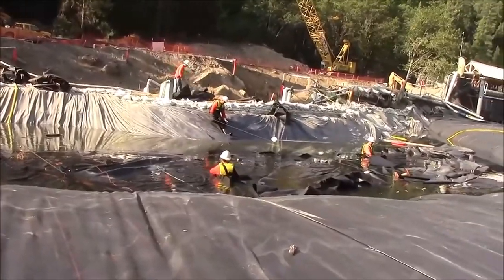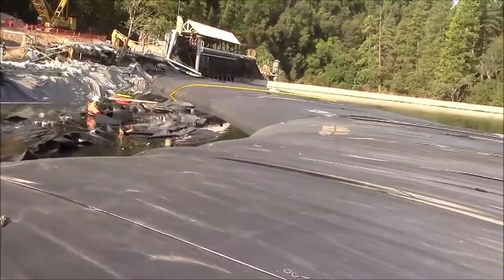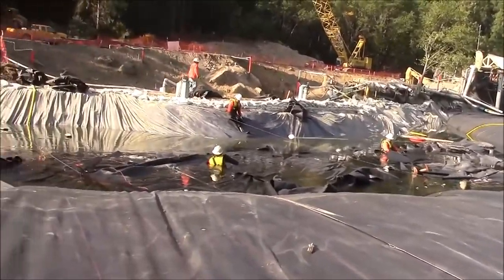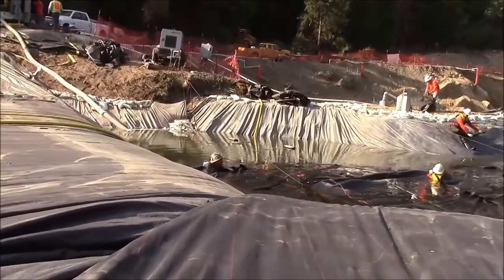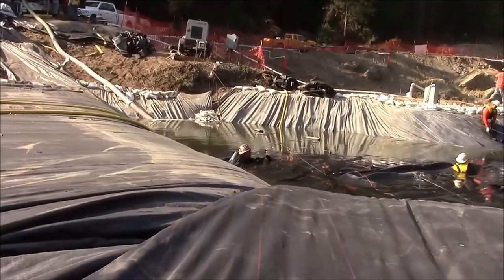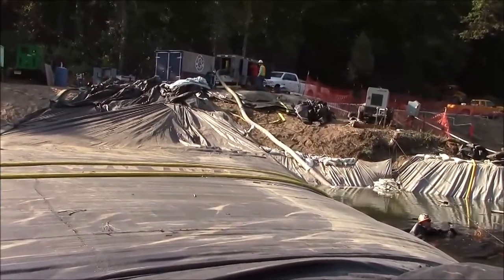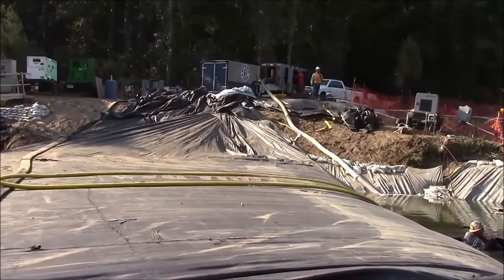The aquadam was installed and allowed to unroll past an invisible line going down the middle of the river called a FERC line. Because of this limitation, we had to be within the FERC line. So to move the aquadam during installation, we allowed it to lose its head, float in the water, and then we slowly pulled it in place laterally with the use of ropes tied to the bottom seam and equipment on the other side of the pit.